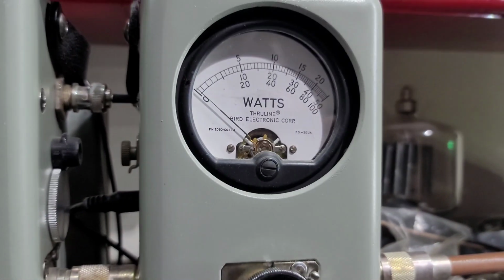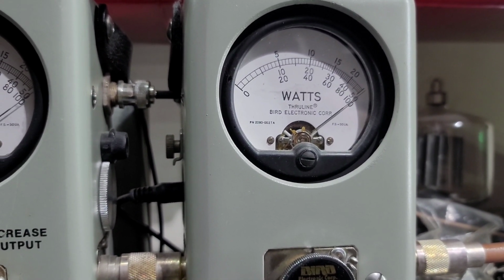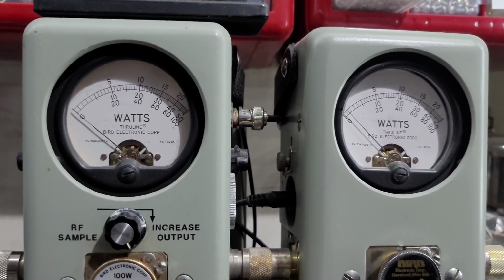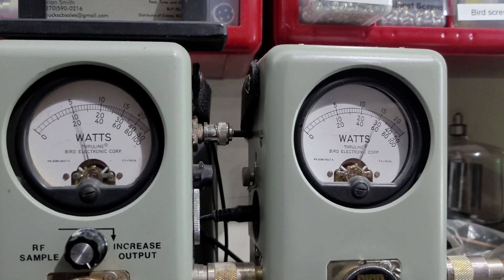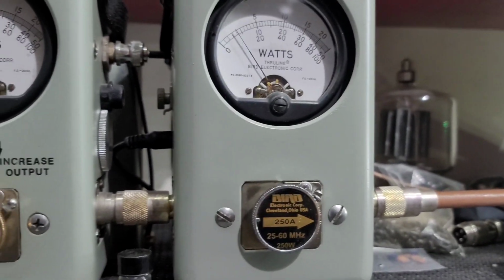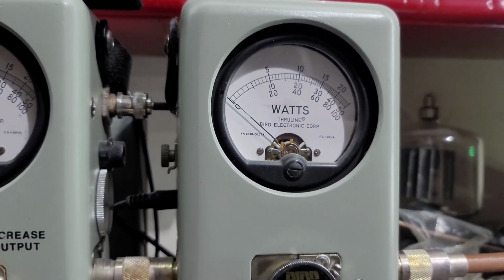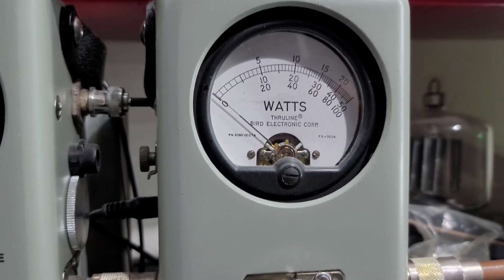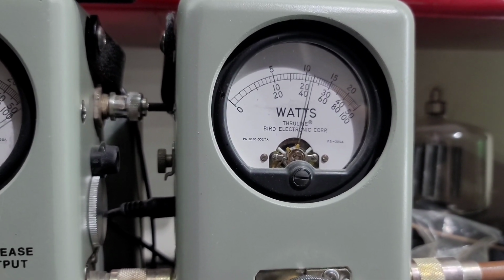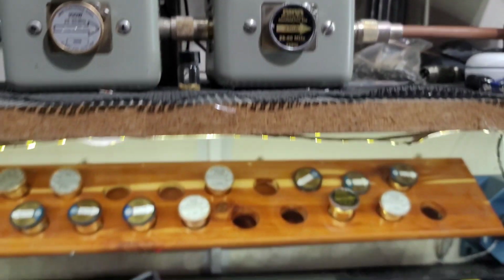Let's go over into 250-watt slug, peak power. Hello, 1 2 1 2. Hello, hello. 250 watts easy. Roll it all the way down. Hello, 1 2 1 2. Same 250 watts easy. Let's go here to average power, since we were pegging up the 100-watt scale, and see if we're just barely over 100 or what. Hello. Yeah, about 110 bird.